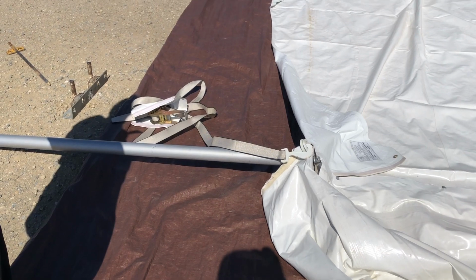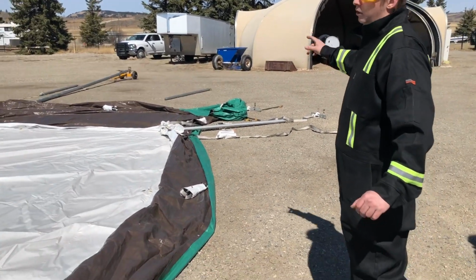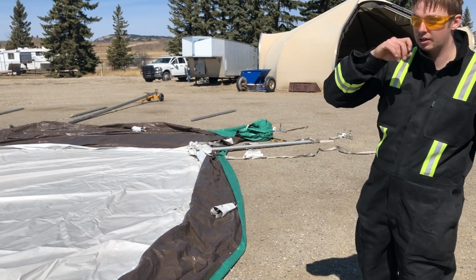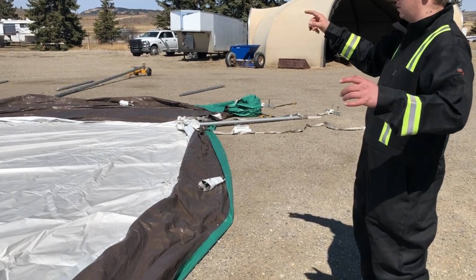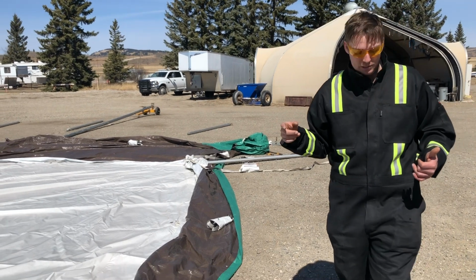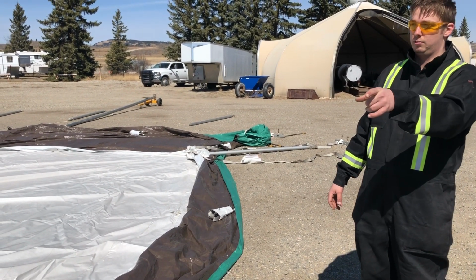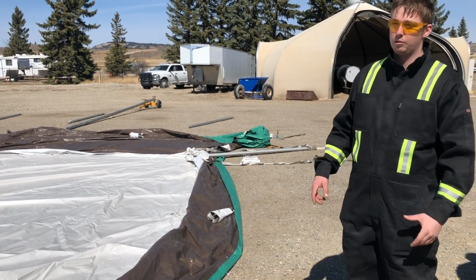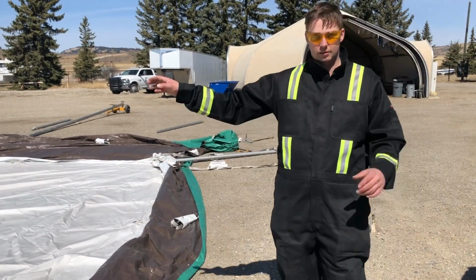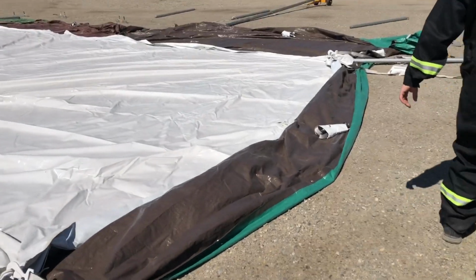Okay. So right in the corner you go. So when you're putting up a corner, start with one, go kitty corner, and then you can go beside and then to the other end. 40 by 40, it really doesn't matter the third or fourth leg that you do. It's dictated by wind, so whatever the wind is coming towards, you want to do that leg last, because you don't want the wind to go up underneath. Yeah, pick the whole thing up and it goes flying. Yeah, the wind will help you when you don't want it to help you.